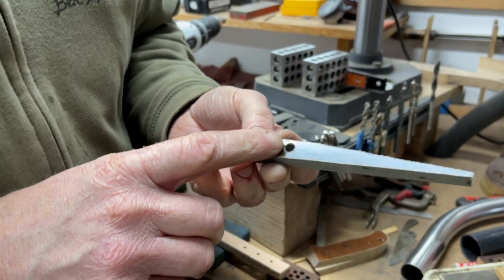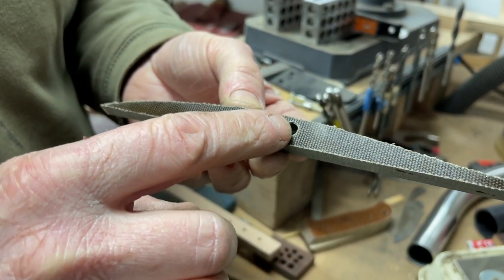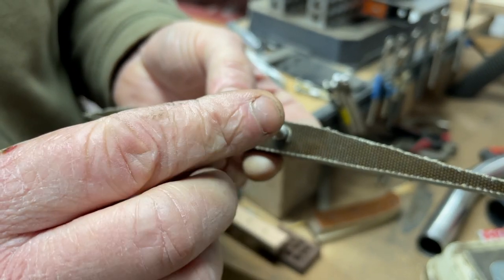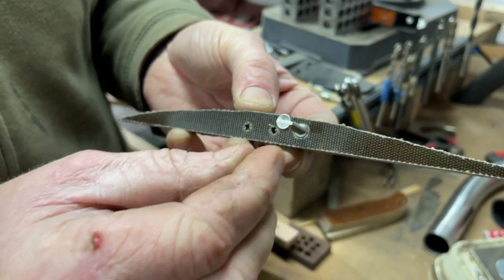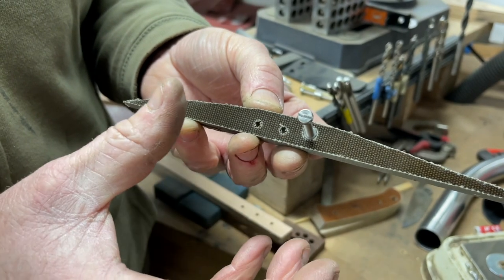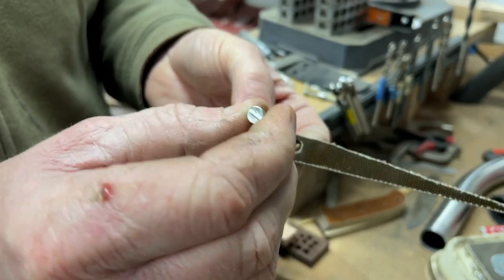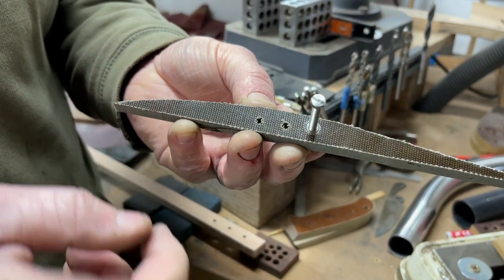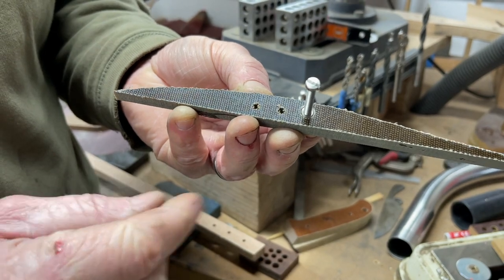You can see that we've got that little shelf at the bottom of the hole. I've just carefully countersunk it slightly to take off the hard edge. These are the quarter inch bolts and that's a pretty good fit — not too tight. Sometimes if they're too tight you can't get them in, and composite handle materials tend to almost close back up slightly after drilling. I think that's going to be perfect for these quarter inch bolts. I'm also going to quickly test it on some wood to make sure it works for both components.